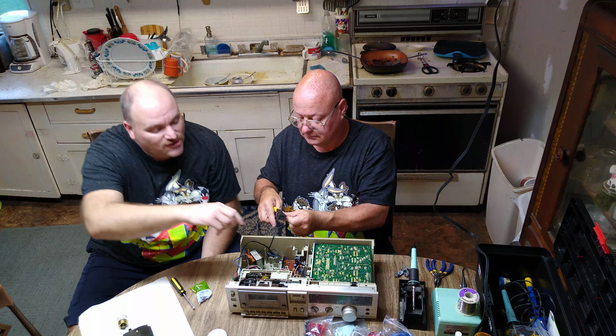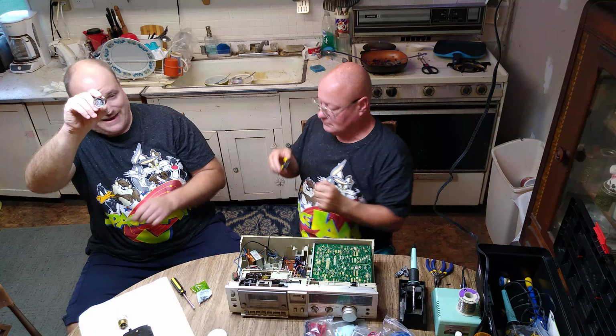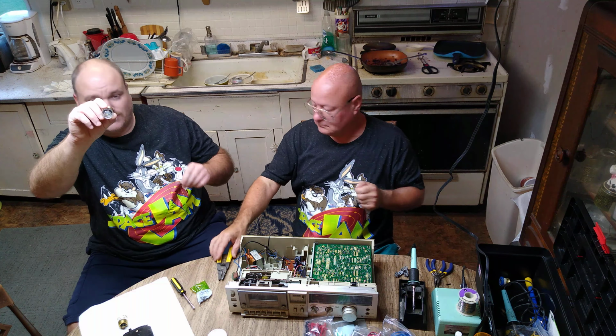When something shorts out in the deck, instead of getting hot and burning up the deck, or burning the cord and getting hot, this filament will burn out before the house fuse blows, before anything gets hot and melts. And UL and the Consumer Product Safety Commission should require these fuses. Yes, they should.